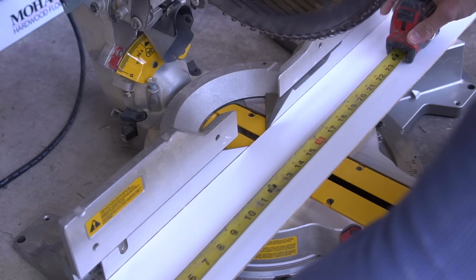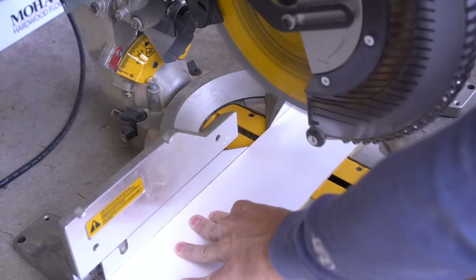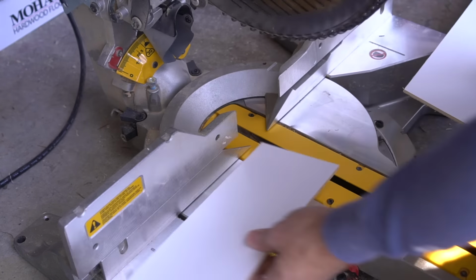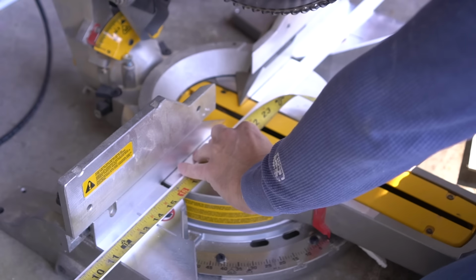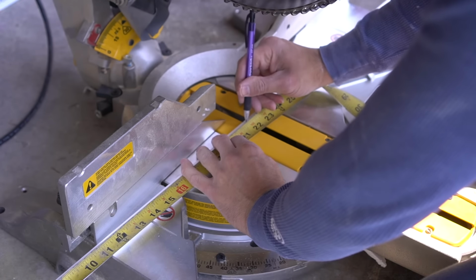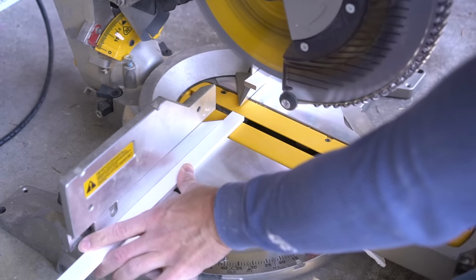Our cabinet system also comes with added toe kick paneling, which I just have to measure out and cut smoothly at a 90-degree angle. As for trim, our cabinets came with 1 inch by 1/4 inch trim pieces. These pieces are placed on the floor as well as vertically wherever our cabinet meets the wall.